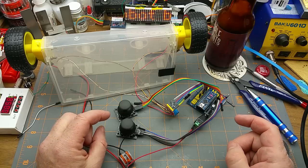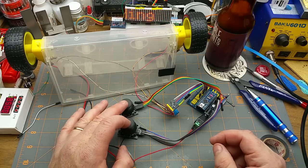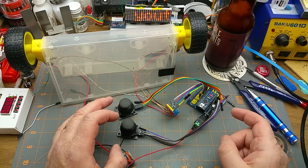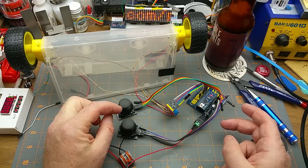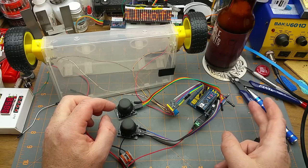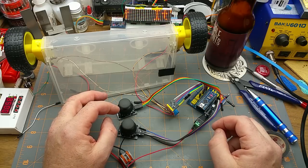So then the next thing that I've come up with on another night is to add these two joysticks to a couple of analog inputs. I've got them on analog 0 and 2, just the vertical, up and down. I haven't got the side to side connected yet, which is why I left the odd numbered ones not used. I thought I might need those at some point, so I just reserved them. I know, how often do you think about the future?